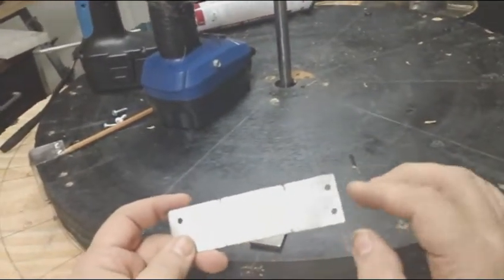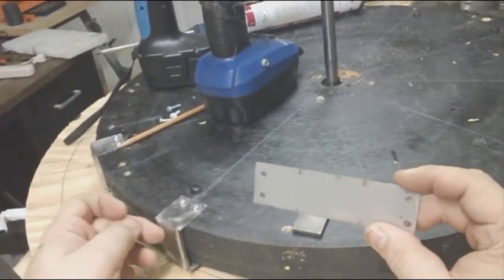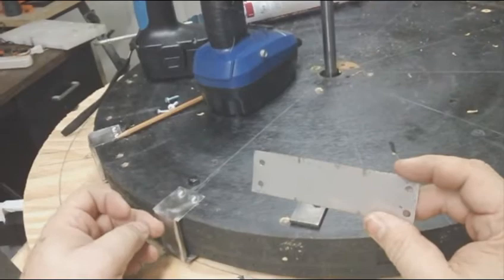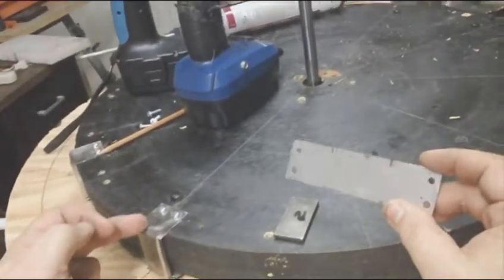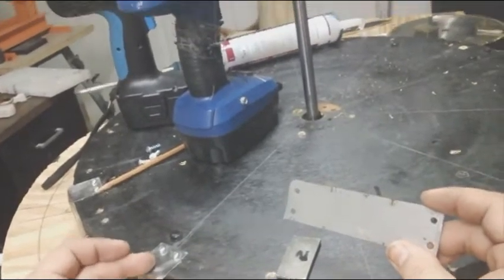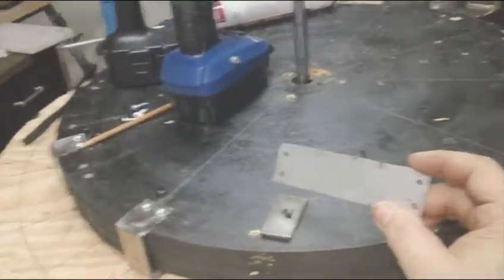One of the main reasons is that when this wheel is spinning, as the coils out here fire against this magnet, it puts stress on this. And if the mounting comes loose, it'll start to wobble. And as it starts to wobble loose, it will work its way out, and you'll have a catastrophic crash of this magnet mount against your coil. It can destroy your motor.